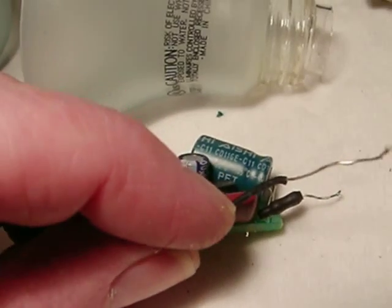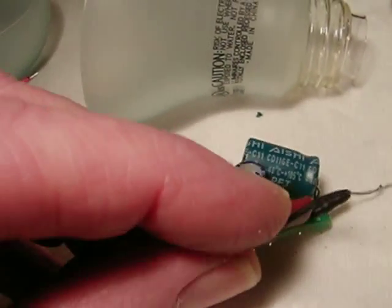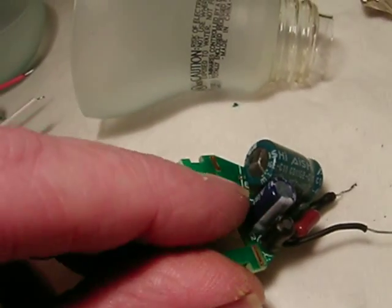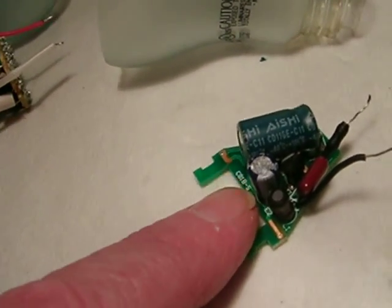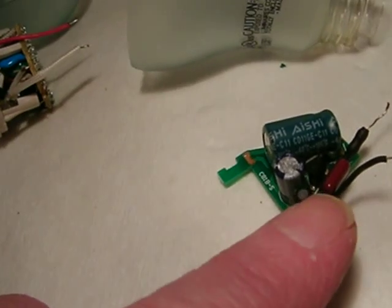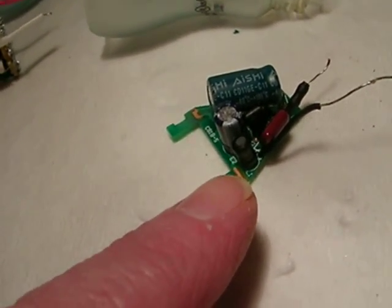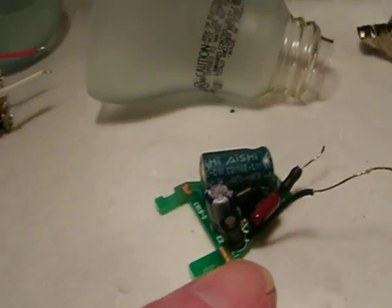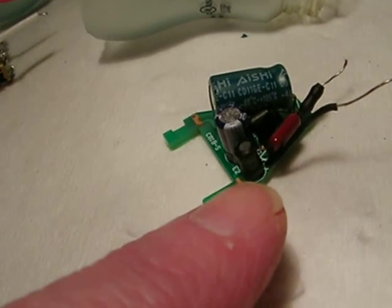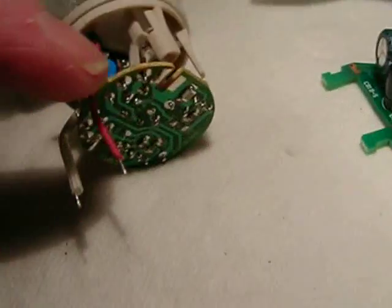In this case you have 0.6 amps for the halogen capsule; the SCR is rated at 0.8 amps, so there's a little wiggle room. As this capacitor charges slowly through the resistor network, once this 100-microfarad capacitor fully charges it switches off the SCR and turns off the halogen capsule. This capacitor will stay charged as long as there's power, and even if you turn the power off it holds charge - maybe 10 to 15 minutes - so it doesn't refire the halogen, keeping the CFL going. The other part of the power supply is just the high-voltage oscillator supply for the CFL.